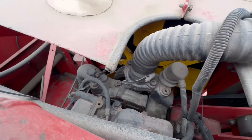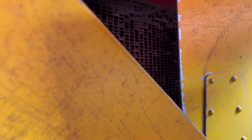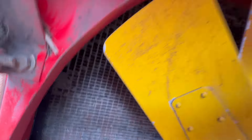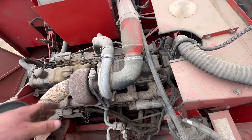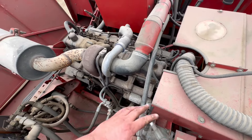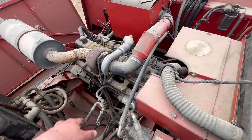You've got to keep the radiators clean as well. In here you can see there's a bit of muck in the top of the radiator, and down the sides there — we need to get all that out so that the engine stays cool. Because if that gets blocked up, the engine overheats. And if you don't stop it before it overheats, the sensors will stop it for you — but if you keep cancelling it, the engine will get too hot and it'll just knacker it.